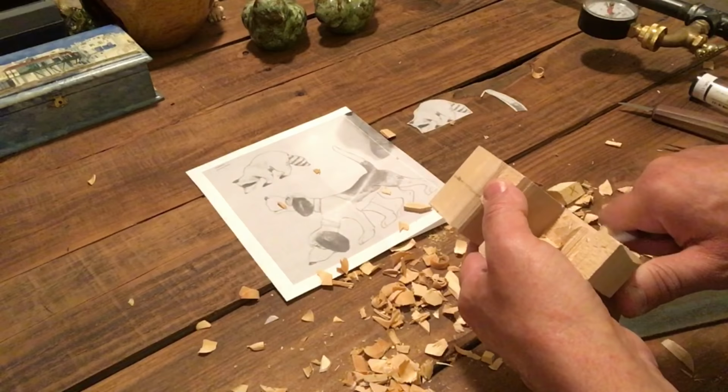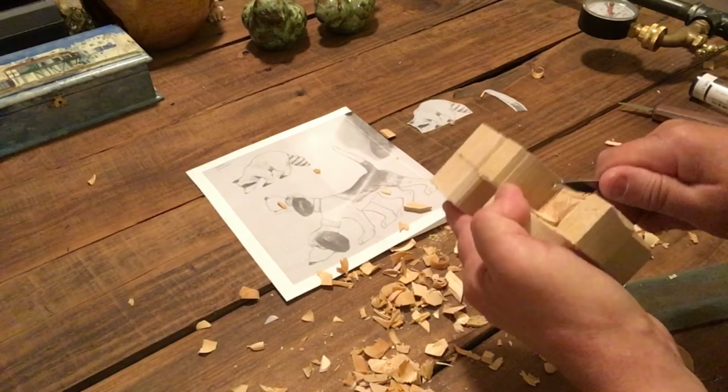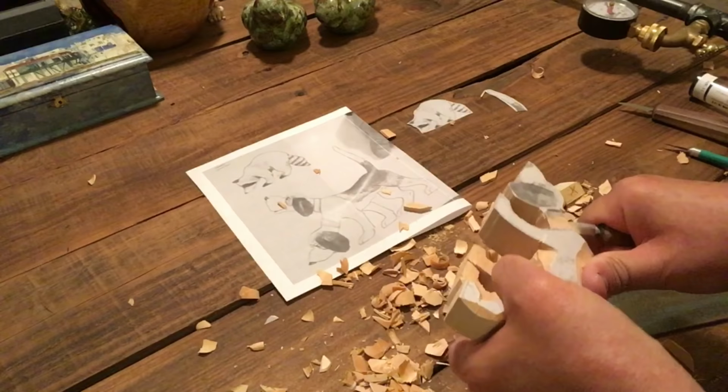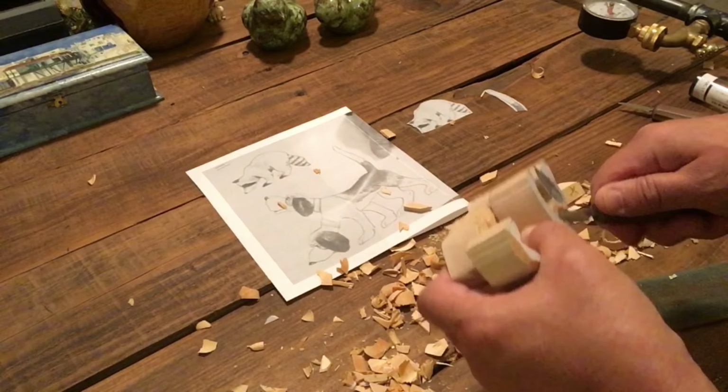So as you can see, I'm going around just cutting a 45 off the corners. And what that does is it just makes it a lot more comfortable to hold in your hand. You're basically using your hand as a vise and you're holding this piece of wood, and those sharp edges can get to you after a while. So you just knock off the edges with a 45 degree all the way around, and it just becomes a much more pleasurable experience